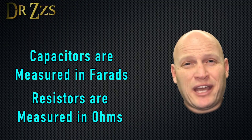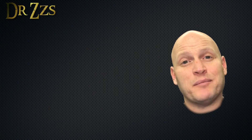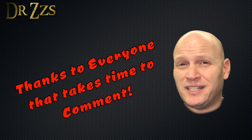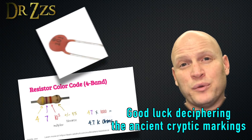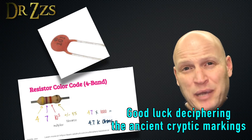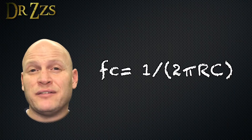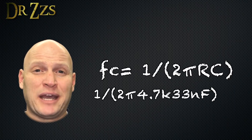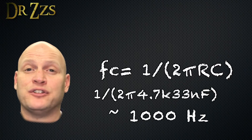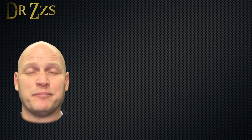The size of the resistor and the capacitor isn't terribly critical. I first learned about this solution thanks to a guy named Alex Gorgio. He recommended using a 4.7K resistor and a 33 nanofarad capacitor, but those numbers are not set in stone. Using the filter frequency equation, a 4.7K resistor and a 33 nanofarad capacitor gives us a frequency cap of 1000 Hz. Most of the stuff we want to filter is going to be quite a bit higher than that.